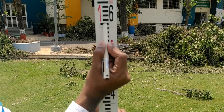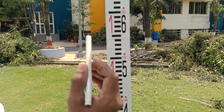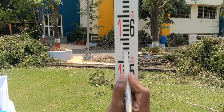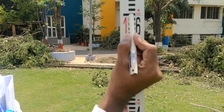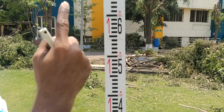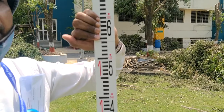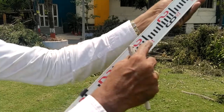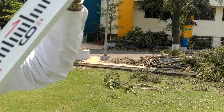So C is 4 black strips, and D is whether it is the bottom of white (D = 0) or the top of white (D = 5 mm). Here the reading is 1.540. If the cross wire is at the bottom of a black graduation, the reading is not 1.6 because 1.6 is at the top and is yet to be completed. Counting back: 1.5 plus nine black strips completed gives 1.595, and since it is at the top, D is 5, confirming 1.595. For identifying the meter value when the view is partially obscured, there are dots: one dot after 1 meter, two dots after 2 meters, three dots after 3 meters.